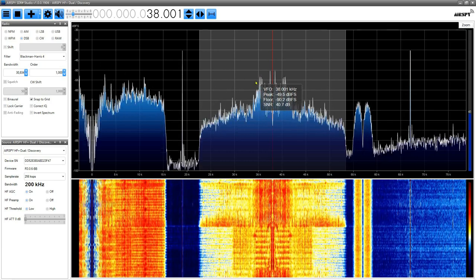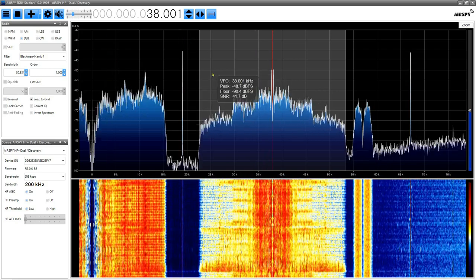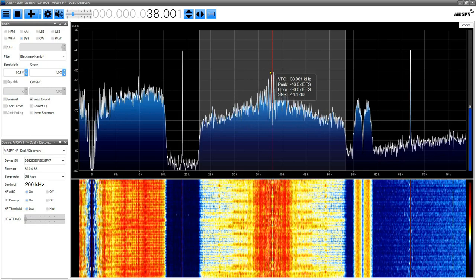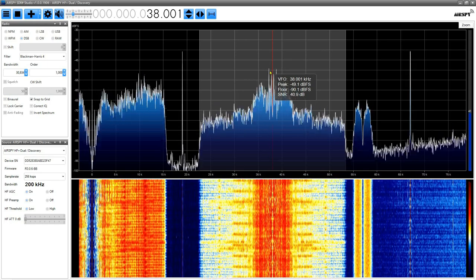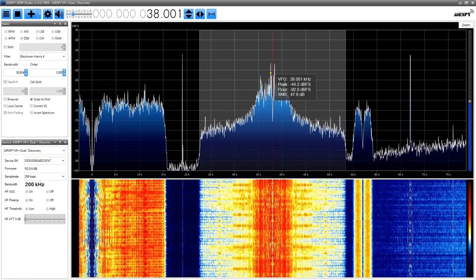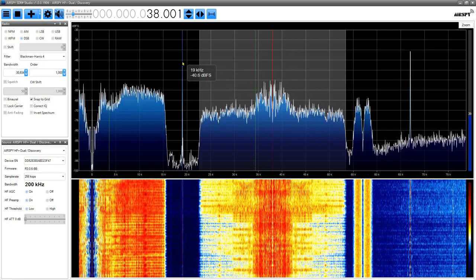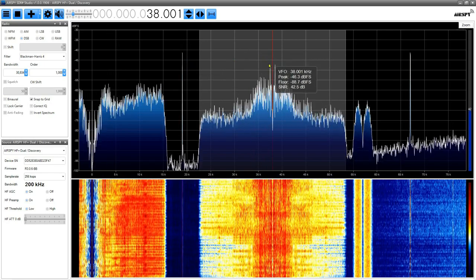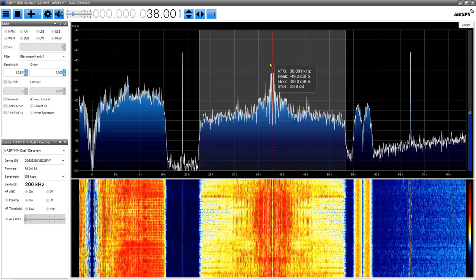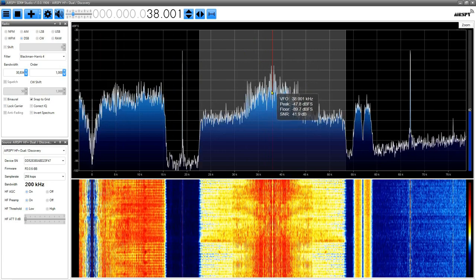We're all familiar with single sideband, but this is double sideband, and it needs the exact phased carrier to bring it back. We usually use, in the amateur radio world, an oscillator that runs, and we tune it back and forth till it sounds really good. But if you have a reference signal like this and make it phase stable, you do that by multiplying this carrier times 2, and it ends up being the exact carrier that you need to decode this.